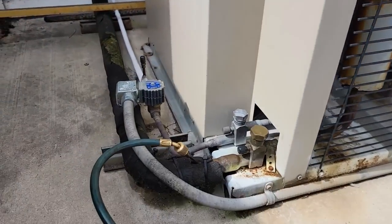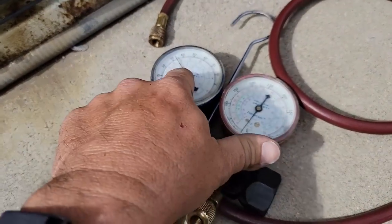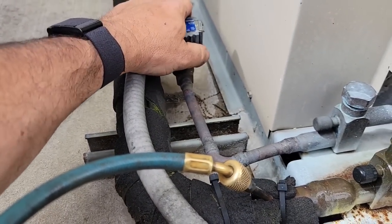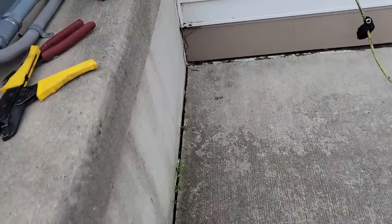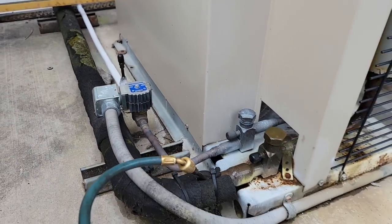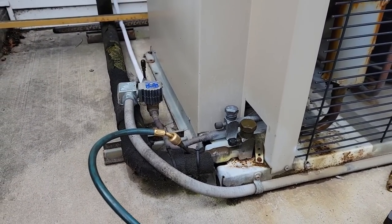So can't help but notice this little problem — see that? Yeah, that's not normal. I don't know if it's just getting hung up or what, but looks to me it feels like it's energized. Man oh man, you got all these freaking things I got to do today and I ain't got time for all this extra crap to be piled on top. So it's calling to be open — it's restricted. Probably can take it apart and clean it, pull the solenoid off there and open and close it a couple of times. But it's going to do it again.